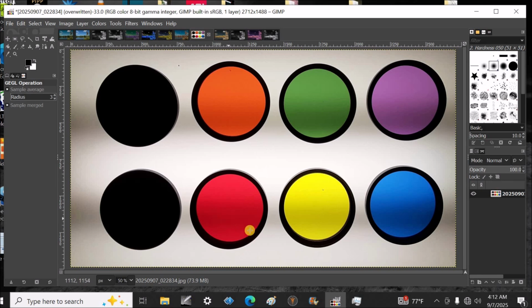So the red one, since the end of visible light is around 700, I'm thinking this is, I'll just guess it's 650. I don't know the exact number. So we'll say that's around 650 nanometers. It might be 630, whatever, 660. It's kind of irrelevant to me, but if you go out and buy them, they'll have specific numbers. Orange is usually, I think, around 590 nanometers. Yellow, I think, is around 550, or maybe even 510. You'll see numbers like that.